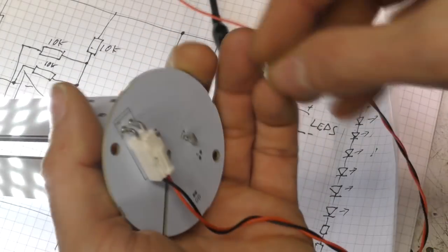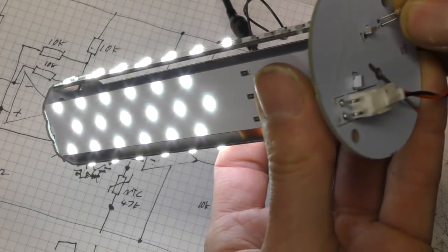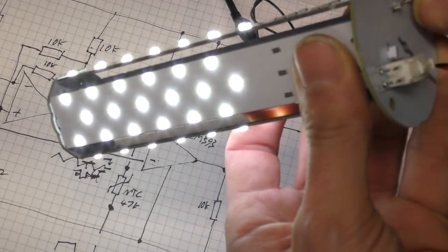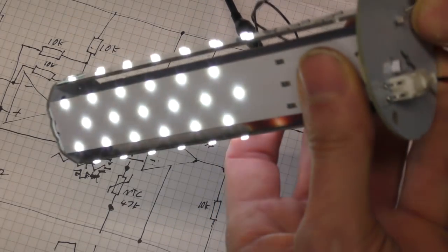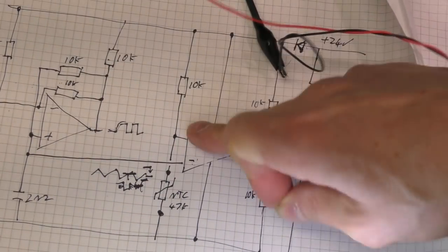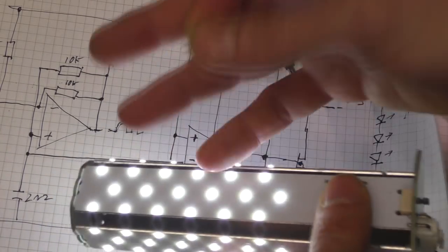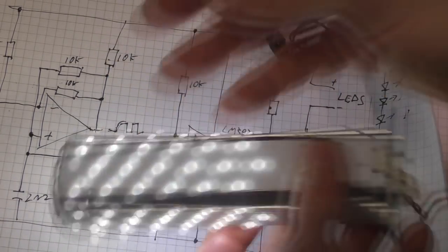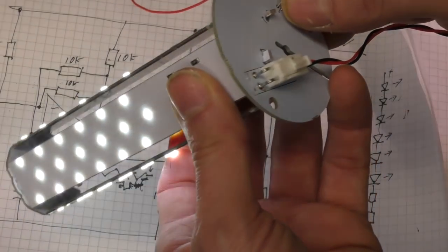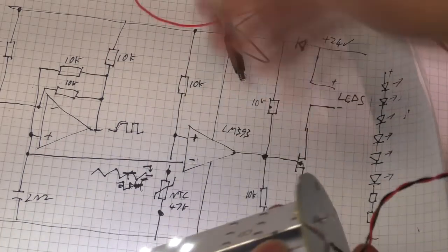And to test the limiter circuit, all you do is take a 10k resistor, connect it across the test points, and observe that it goes dimmer. It doesn't go off. It does change, but it doesn't go off. So this effectively tests this entire functionality, because any open circuit here would mean that the LEDs were on and the limiter wasn't working, so what you're simulating is literally that thermistor going down in resistance, just to show that pretty much everything is functional.